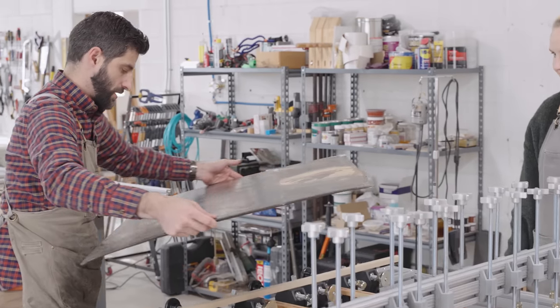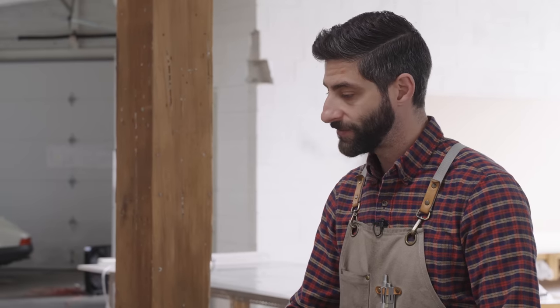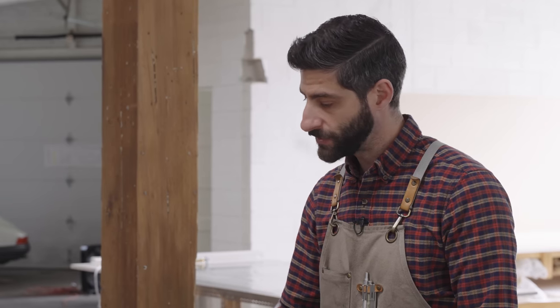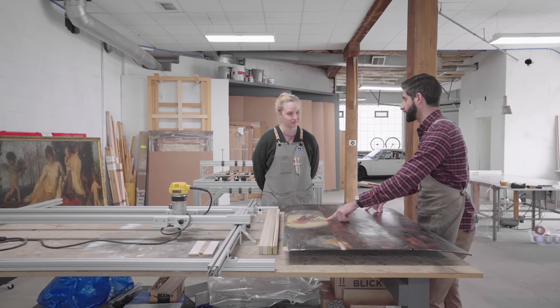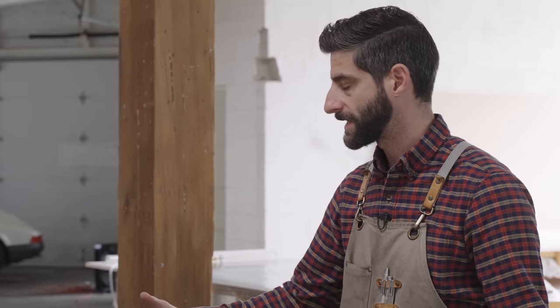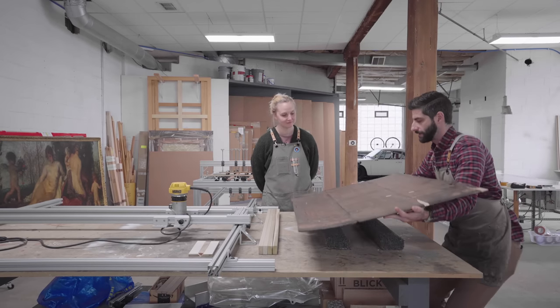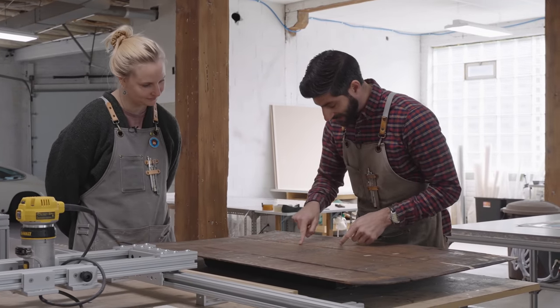The painting did not fall apart — that is our first measure of success. So we've glued it back together, but it's still not really structurally sound. It's only a quarter of an inch thick, and some of these joints are starved or just not great. My big concern is that if we just keep it like this and put it in the frame, as the painting continues to expand and contract, the stress on these joints is going to cause them to burst or open up.